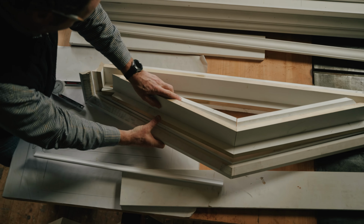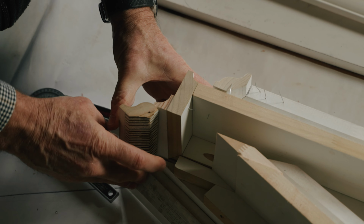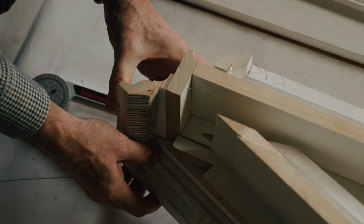And you'll see on the back side of this cornice, which is just tacked together, if I show you the back side, right, how this pitches and how this is separate from that cove molding, right? So that this is a separate molding from this. They're not even the same woods, right? But that's a way to get around playing around with this pediment and playing with those raking moldings and these different cuts.